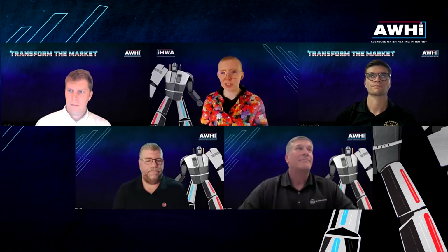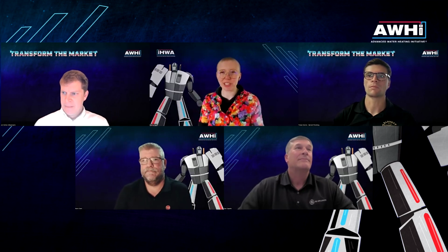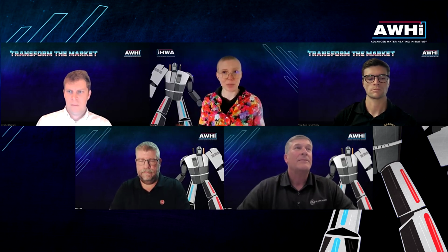Yeah, and I actually see in the chat Amelie, who was one of our panelists in the last session, which was about load shifting, mentioned if you have your heat pump water heater set at 140, then it makes it difficult to do the advanced load up if you're doing a load shifting protocol. So I don't know if there's anything you, Dan or Kevin, want to comment about that, but I did want to just call out that aspect of it too, since I know that's kind of an emerging area of interest.